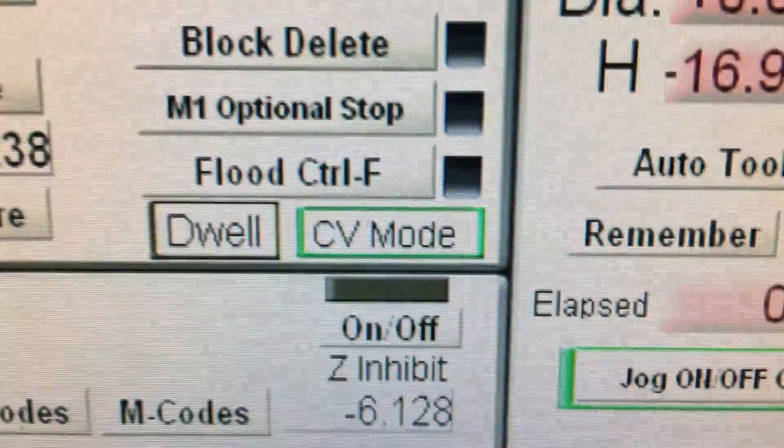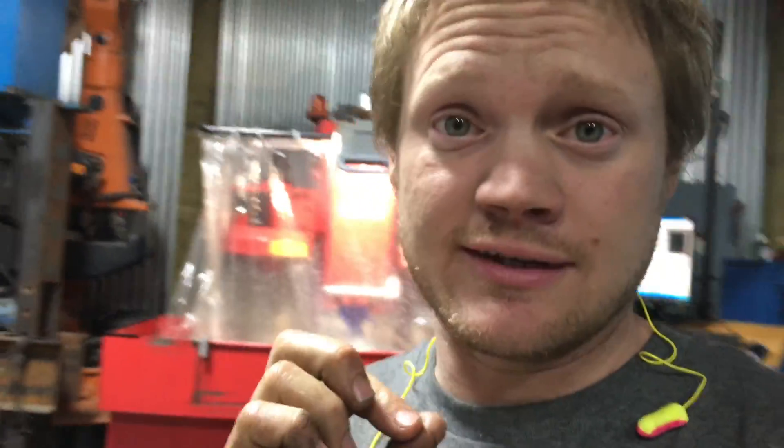See the little green box around constant velocity? It's on now — thank goodness, because that would have sucked. Spindle bearings, as a general rule, are insanely expensive. Spindle bearings for this machine would probably cost us $10,000 to rebuild if we crashed it, and it has ceramic bearings so it can take about one crash and that's it. For the other machine, I can pick up bearings off eBay for about $300 and change them myself, though it's still a pain.